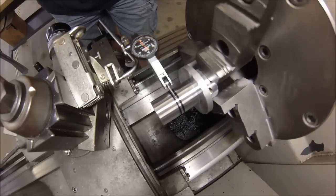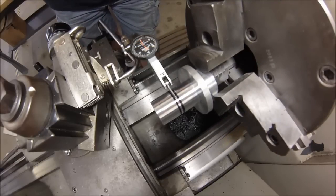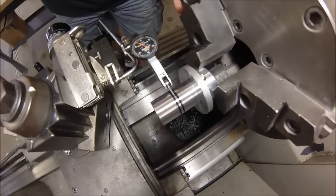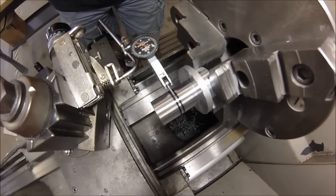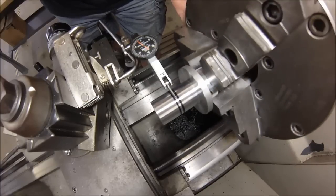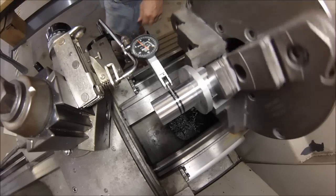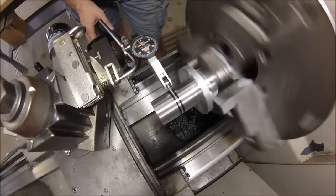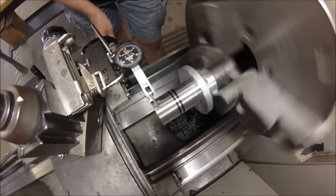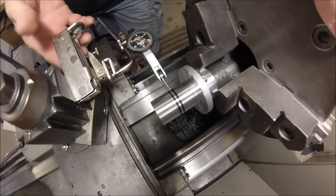There's a high spot. There's a low spot. A little too much. I would say that's pretty close — and I'll bet it's under 46 seconds too. This diameter is running good. The face is running square. That's the part.